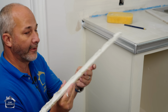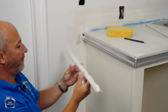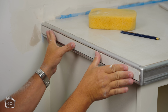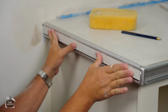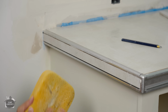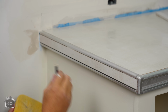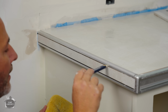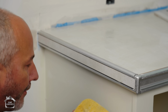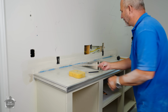Ultralight carries 40 pounds per square foot on a ceiling. And in this scenario, if you put it on nice and thick like this, you can recess it in the hole and then press and squeeze the extra cement out right until it's flush. And you don't need to add any tape or anything else to set this up. Just get it flush. Again, use your pencil. Clean out your grout line. There's no fussing around tomorrow when we come a grout.